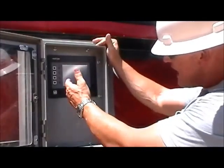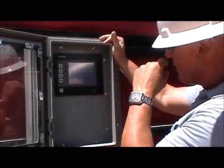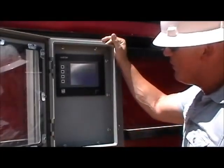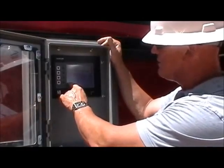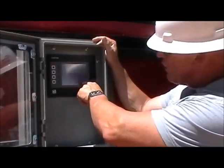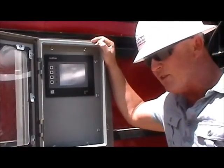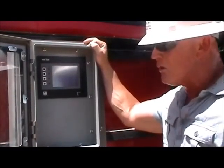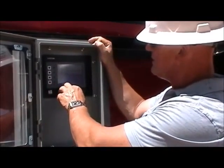Under the stat menu, we'll get total chemical volume and total water volume — however much we pump through the system — and it reads and records this into the data acquisition system. The maintenance screen tells us the pump's hertz output and current draw, so we can determine if we're under heavy load during the operation and identify what's going on with the pump as we're pumping chemical through the system.